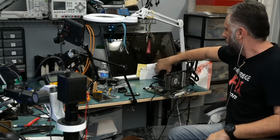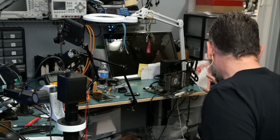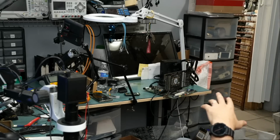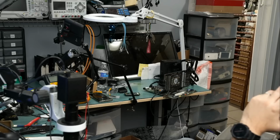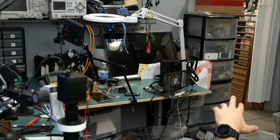Turn the power supply on and run for your life. Right now, we do not want to hear 6 beeps, and we want to see something on the screen. If we do see something on the screen, problem is fixed. We still have to order and solder that chip, but for now, we can still test it.